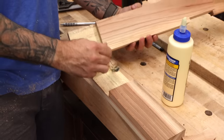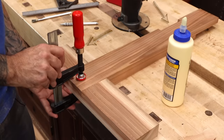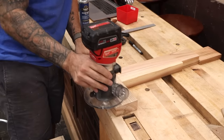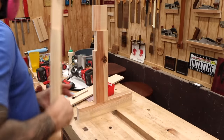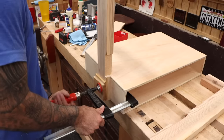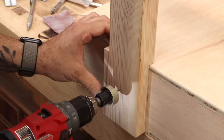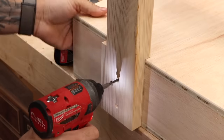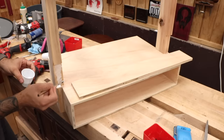Time for the glue-up, starting with the leg and the foot. It's super important that you glue the foot on the right way — the short side of the foot should be on the same side as the stretcher notch. Glue and a clamp is really all we need here. While the leg assembly is flat, go ahead and add some of those eighth-inch roundovers. Once the leg assemblies are done, double check that they're mirror images. To attach the legs, turn everything upside down and drop the leg onto the box in the proper front-to-back location. If you don't have a clamp that's big enough, you can shoot a couple of brads in there to hold it in place while you add the screws. I just waited for the glue to set up and then added a couple of screws, being super careful about the length — I really don't want to punch through that plywood. Now we'll fit the support stretcher, cut it to length, and then glue and brad nail it in place.